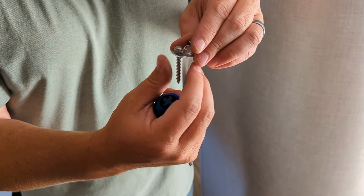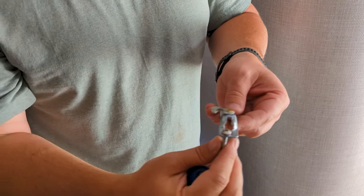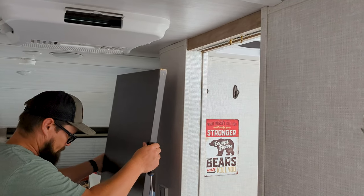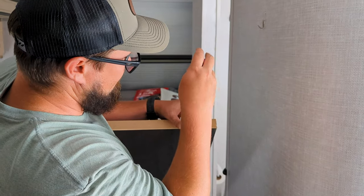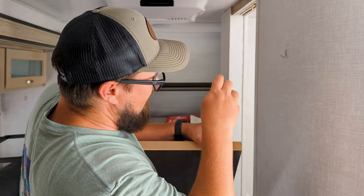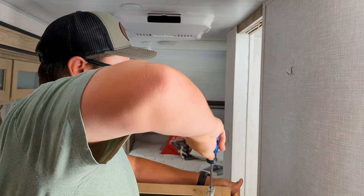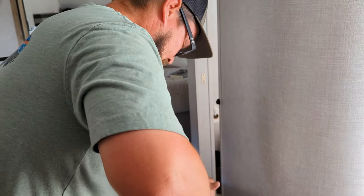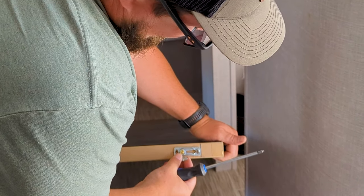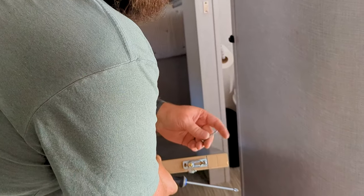So hopefully they don't interfere with that piece sliding back in here, because we have to be able to slide that past that to get it back on the bracket that's hanging. We're just going to screw these in — they're a little bit larger. You could add glue if you felt that was necessary, but these are biting really well. This is a hollow core door, so it reaches a point where it's no longer biting anything — it's just a longer screw. You want to make sure that you get this bracket centered so that your door rides right in the middle of that pocket.